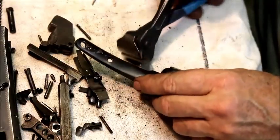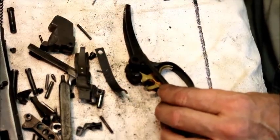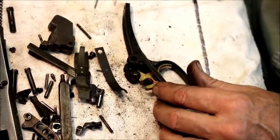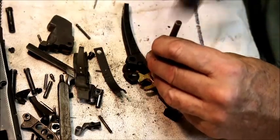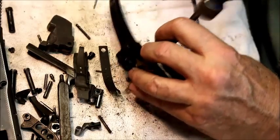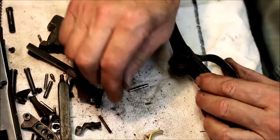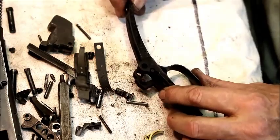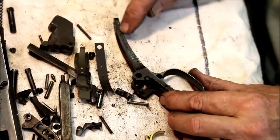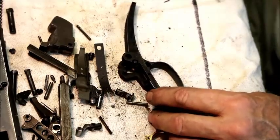Let's get into our receiver now. We'll grab it and pull it out with my trusty cutters. Now let's go ahead and take out our trigger pin here, get the trigger out. Then our trigger plate will be torn down completely. Be careful — don't lose your little detent ball there; they want to roll out and get lost. This gun is numbered on the guard, so when I blued it, I won't have a problem finding where that gun goes. So we're all torn down and ready to blue.